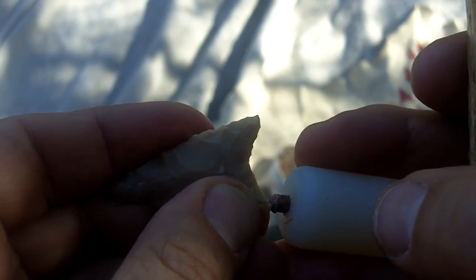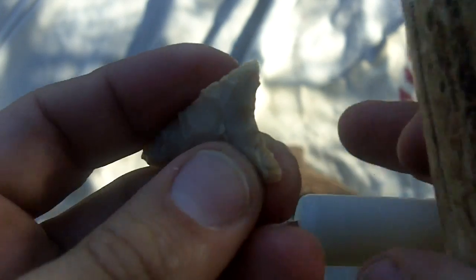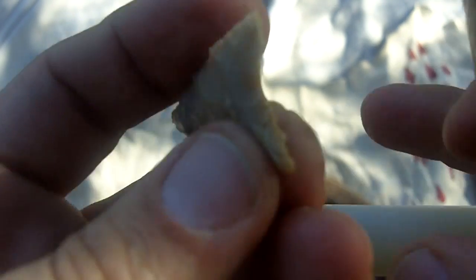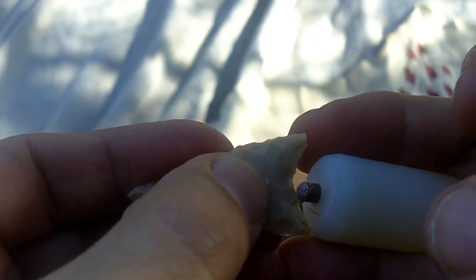I'm just trying to clean this up a little bit. I can do this now while the ears are relatively thick — I can bang on the ends like this. I've got to make sure that the ends of those barbs or ears or whatever you call them are thinned out first before I move further into the point. I won't be able to thin these very effectively later.